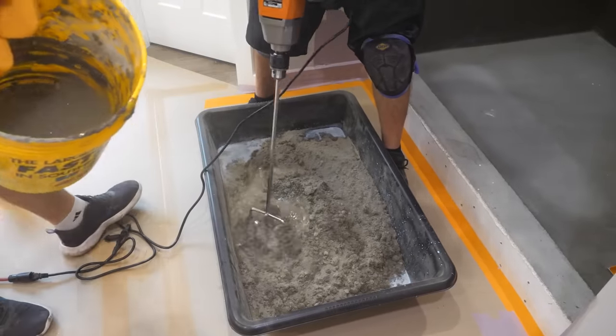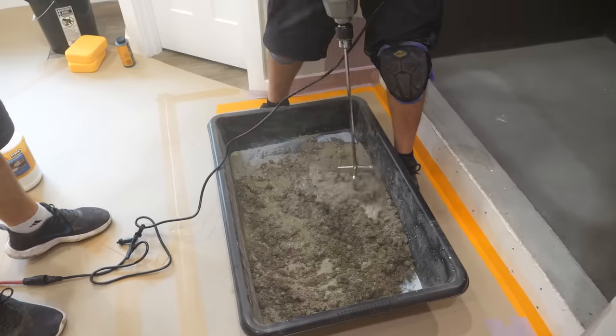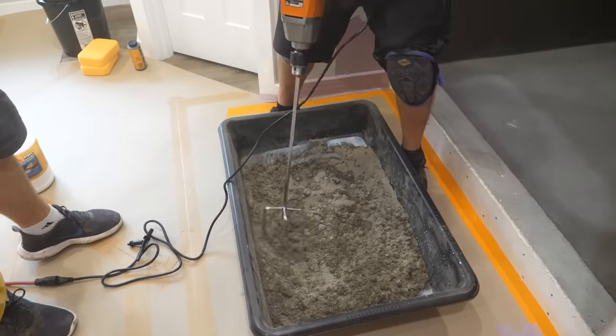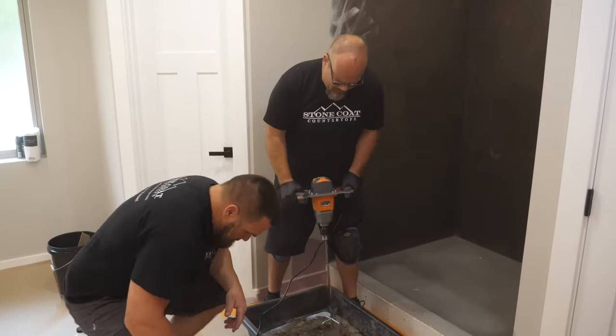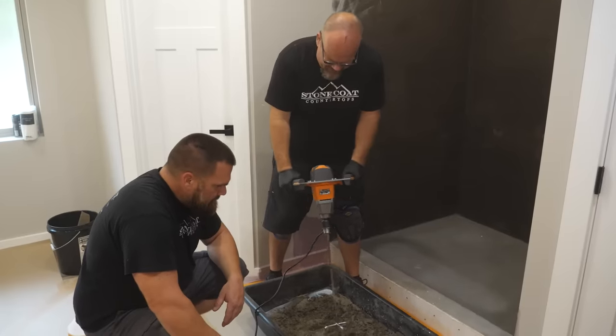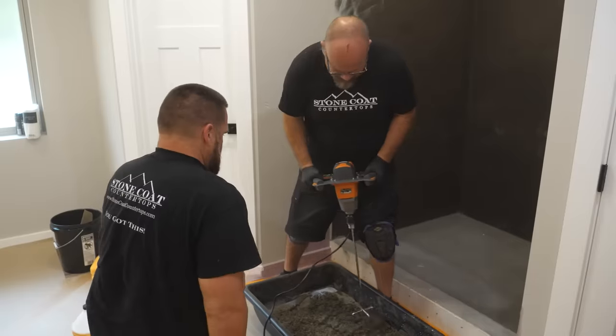It's so easy to overmix concrete. Especially the non-aggregate sections in it, right? Yeah, this is the aggregate, and this is sand. You don't want aggregate in a mix you're gonna stamp, because your high points are gonna be rocks. And so the sand in this is actually what holds it all together, like microscopic rebar.